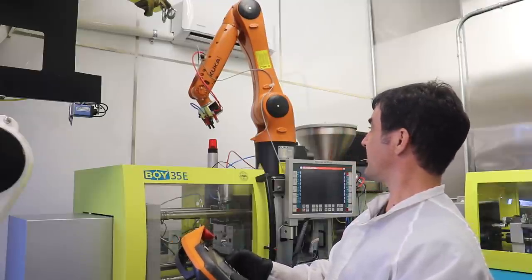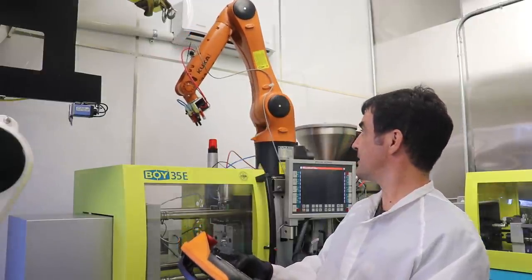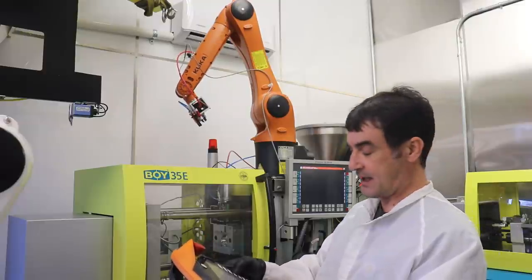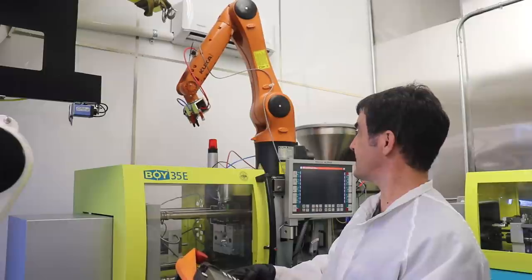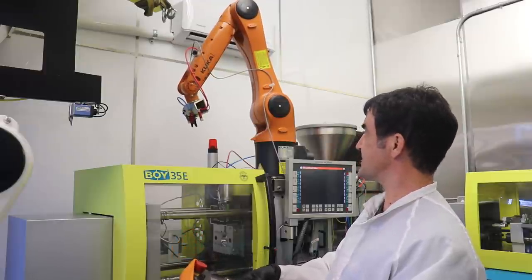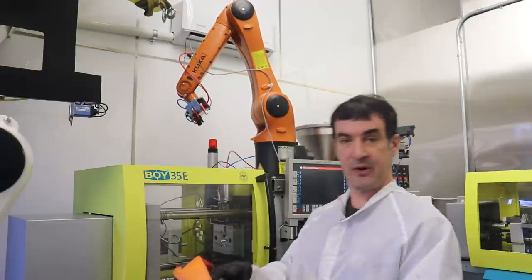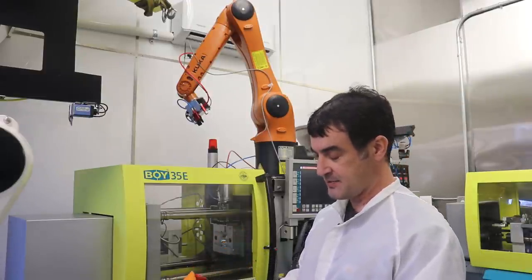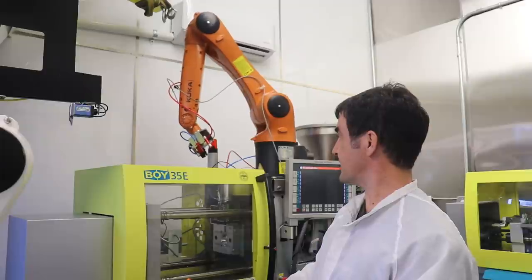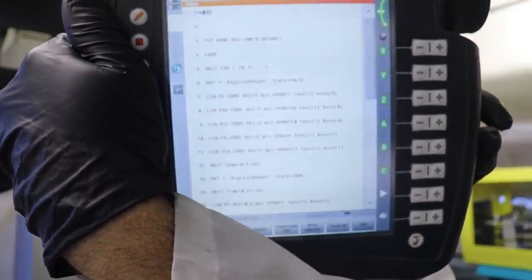you can move the robot around in an X, Y, Z coordinate system, like Cartesian coordinates. I can move the robot around, and here's the orientation. I can change X, Y, Z, and A, B, C, and A, B, and C are the three angles for the end of the robot. The process that you follow is that you manually guide the robot around to the positions that you like. Here's the third axis. Once you're there, you start writing your program by recording the points. Most of these robot programs, you just move the robot to wherever you want to go and record that point, then move it to the next position you want to go and record that point as well. You create this list of points that we're recording.